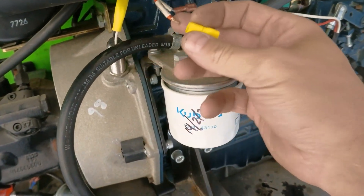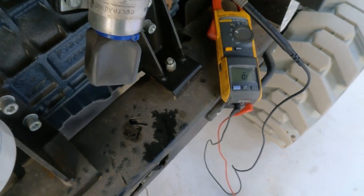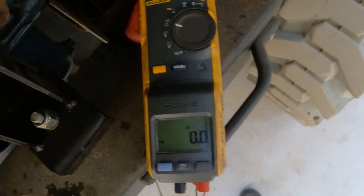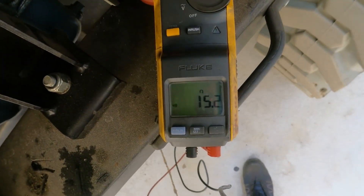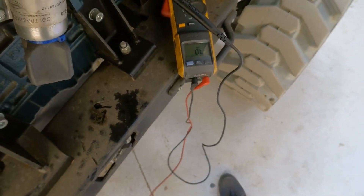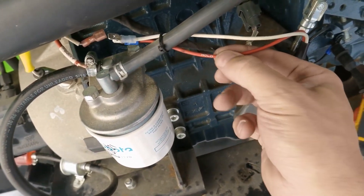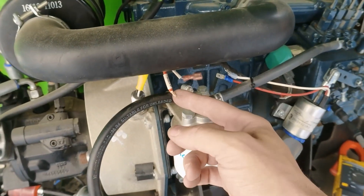Just tried to pull the wire out and the crimp has come off, so it's a perfect time to replace it. One more thing to show — going into resistance mode on the multimeter: if you're not sure which coil is which, you can always check resistance. On the white cable we have nearly zero ohms — very tiny resistance. On the hold coil you have about 15 to 16 ohms. So the hold coil is around 15 ohms and the pull coil is around one ohm. That's how you can identify which coil is which without markings on the cables.